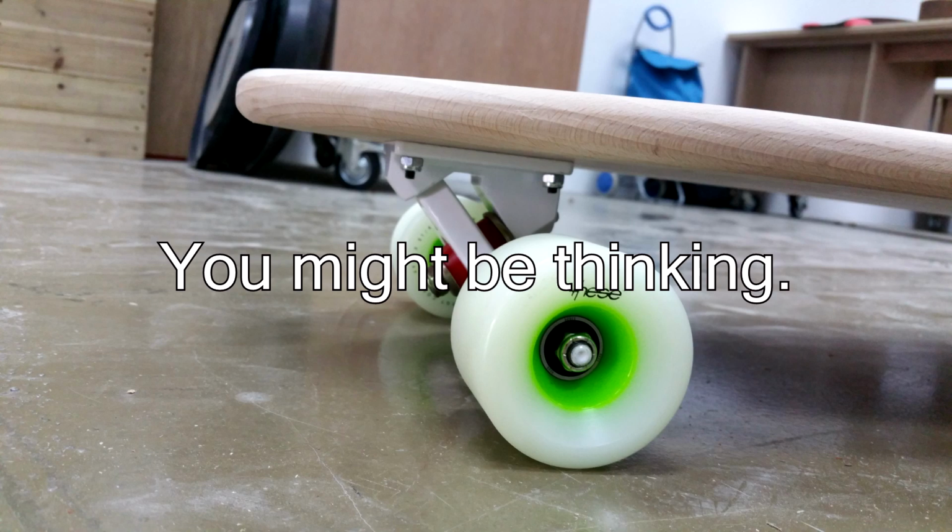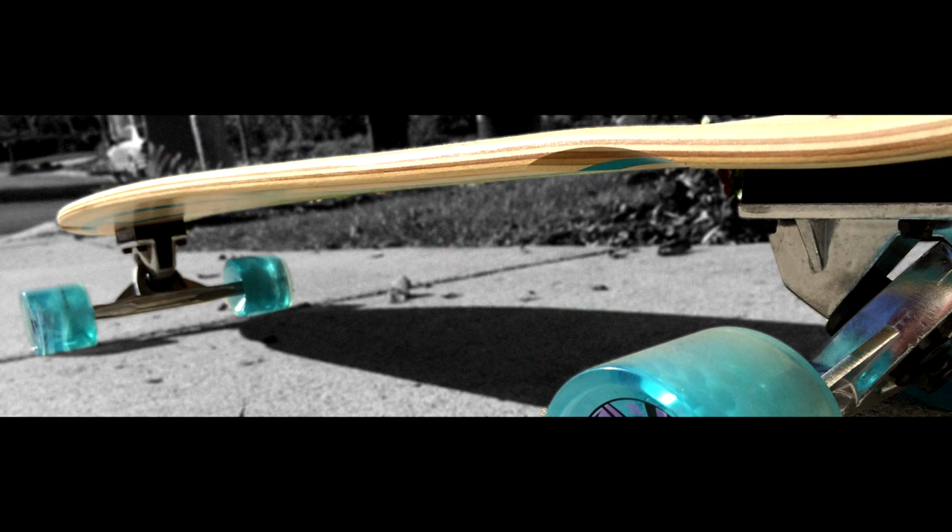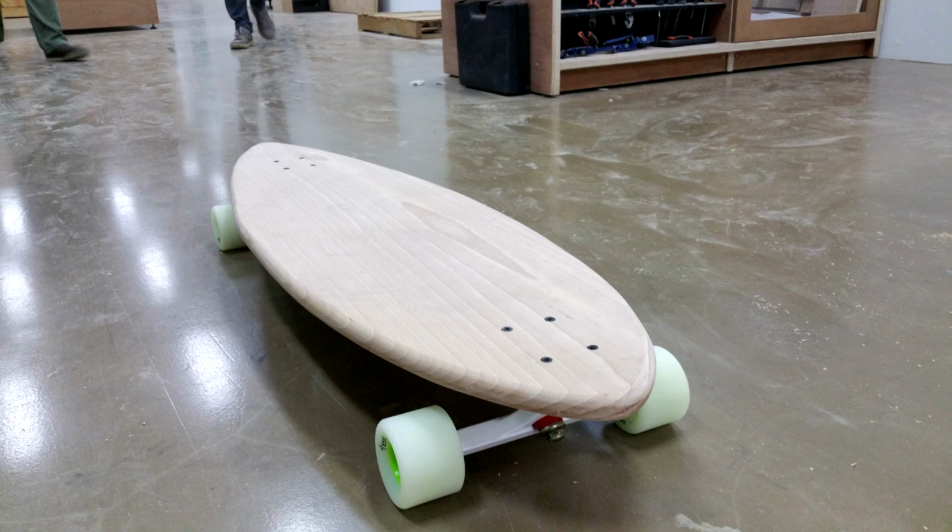That's because this board is made out of a solid piece of wood, unlike normal factory-produced longboards, which are maple wood glued together from several veneers, so it acts like plywood. Plywood has a stronger bond because the wood layers are cross-grained and aligned. With a solid piece of wood, you have to make the board slightly thicker, if not there's a chance that it might break a lot easier. So it seemed to work quite well. I wouldn't say it's the best longboard out there, but for our use, it's good enough.